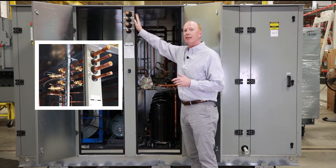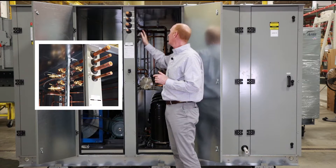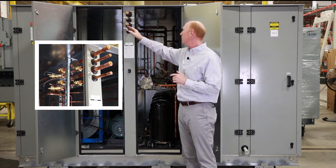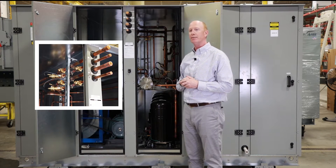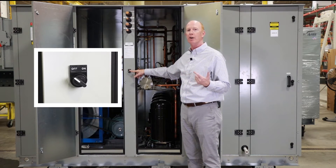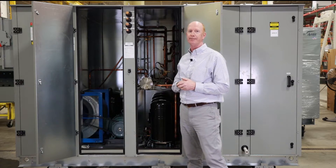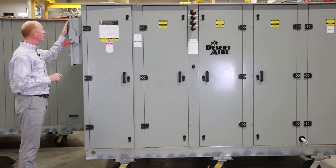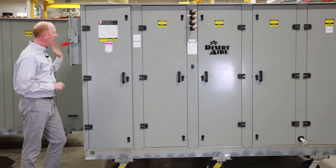One last thing in this area — the stub outs. This is an air cooled unit, so we've got stub outs for the A circuit and the B circuit. The unit is shipped charged with refrigerant; ball valves inside are closed for arrival at the job site. The contractor removes the caps, makes the line set connection, evacuates just the remote condenser, then opens the valves to release the refrigerant. There is also an on/off switch carried over on all grow air units, giving the operator an easy way to turn the unit on and off without going inside the electrical panel. On this particular project we included a fused disconnect as an option, mounted right at the electrical box.